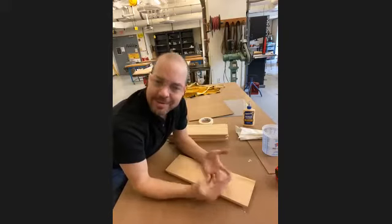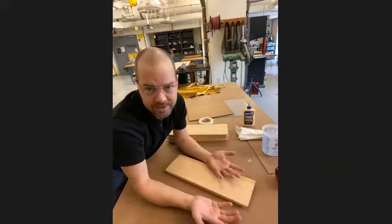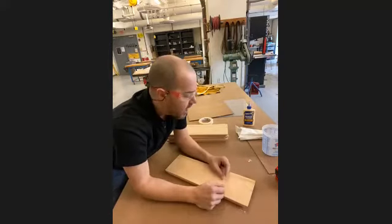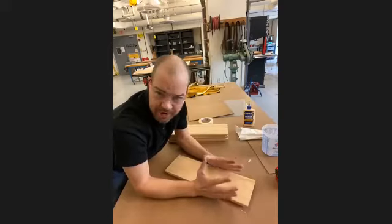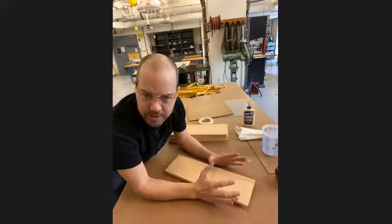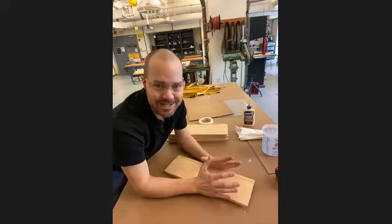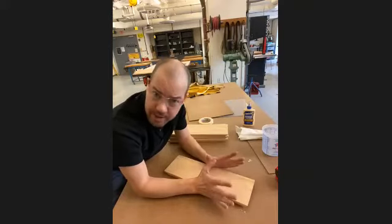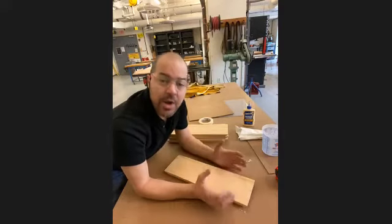When it dries in the kiln it shrinks a little bit. After it shrinks, they pull it out and cut it to make everything even, flat, and squared off. When they do that they lose a little material, and now the wood is three-quarters of an inch by five or five-and-a-half. That feature — when a piece of material is not the size they say it is — is called nominal. Write that down: N-O-M-I-N-A-L.